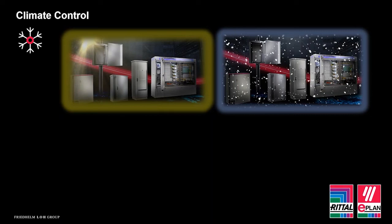Yes, there will be some heat transfer through the walls, but not enough to counteract that equipment that generates that significant heat. Items such as power packs, batteries, transformers, drives are all pieces of equipment that create significant heat loss. And if you have any of these, then I'd recommend you speak to us to help you with a thermal calculation to establish if you need climate control.